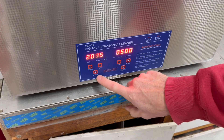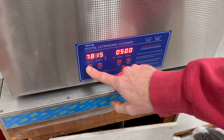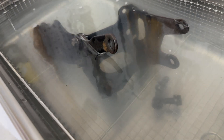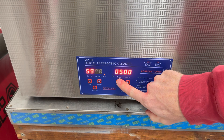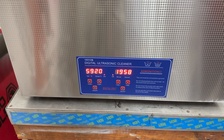Turn on the water heater. The temperature can go all the way up to 80 degrees Celsius. I can see the water getting dirty. This machine uses a cleaning frequency of 40,000 hertz together with 10 sixty-watt industrial grade ultrasonic transducers to remove dirt and stains from the surface of items. And the best part — it's non-abrasive, so it's not gonna pit the surface like sandblasting or leave any scratches like a wire wheel. I only have to set the temperature and the timer and let the ultrasonic cleaner do all the labor while I go work on other projects.